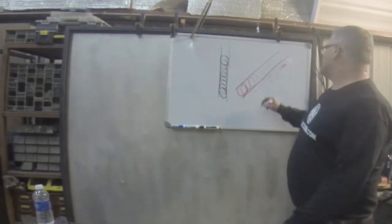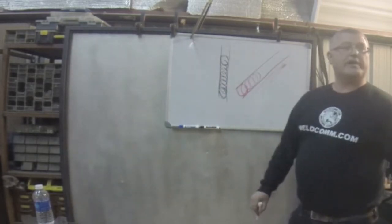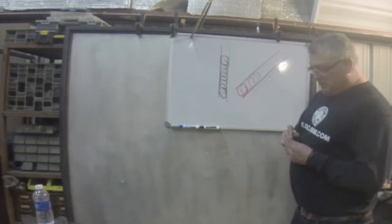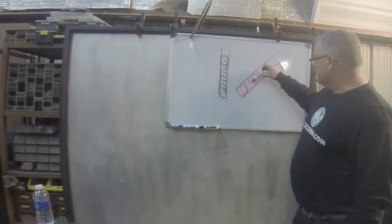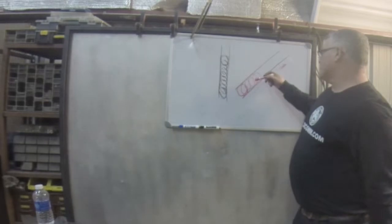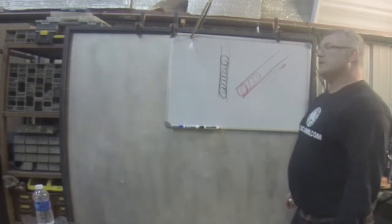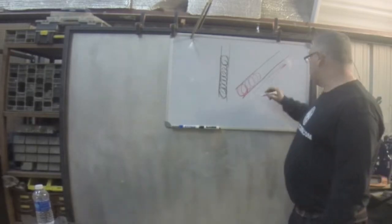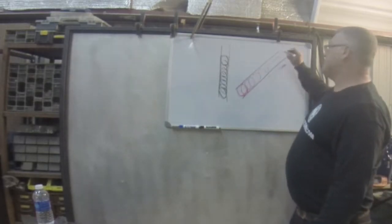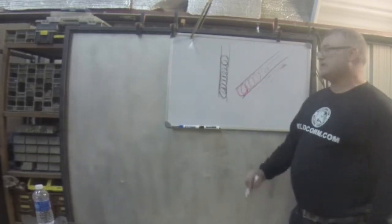Sometimes I think half circle away, start the next puddle. When you're welding, sometimes you don't do anything at all but just hold that stick in the groove. Or with the MIG welder, you're holding it in there. Sometimes you've got old crappy equipment, and you've got little potholes, little dingleberries, and garbage all along your path. Of course you want to clean it up and make it as nice as possible.